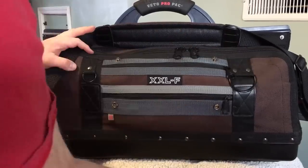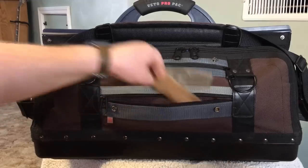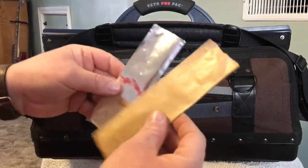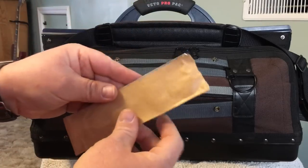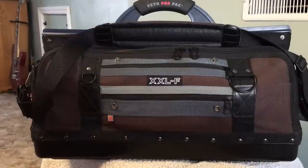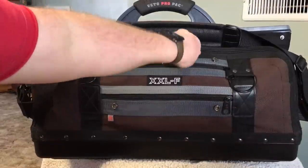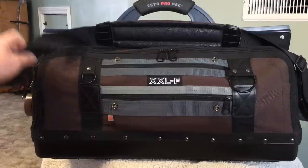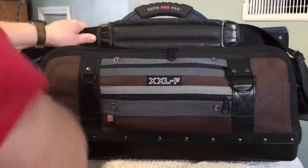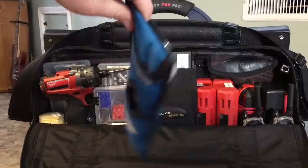I'm a low-volt technician — we do home automation, security, networks, surround sound, home theaters, commercial and residential. In this skinny pocket I keep a bunch of IR blinkers. In the bottom one I keep some earplugs and some aluminum tape — it seems to be the best for sticking to the backs of panels when you want to tie up a bunch of wires. If anybody's got better ideas on the best way to manage all the cables that come with automating a home and using HDMI HD BaseT baluns on the back of TVs, in 25 years I haven't discovered a surefire best way, so I'm open to suggestions.